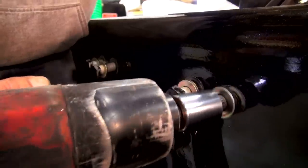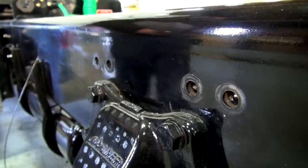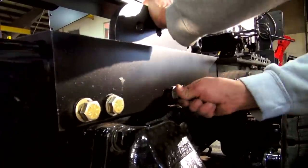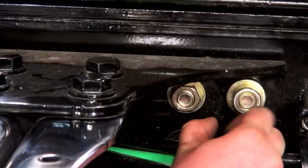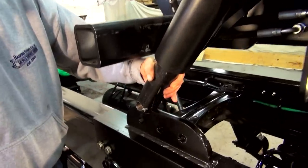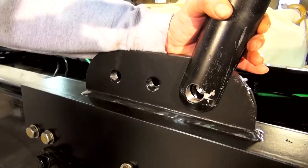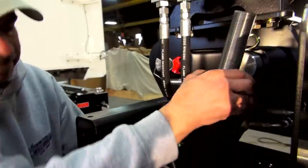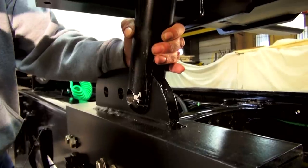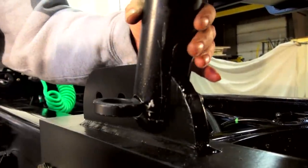Next we'll be installing our frame tabs. We do this first by removing four bolts out of the frame — typically these are around your crossmember or to the fifth wheel plate. We use these holes and scribe them to the frame tab. Now that we have our frame tabs drilled, we're going to be bolting them to the frame. We're using four 5/8 grade-8 bolts and just snug these up until they're hand tight. Now we'll install our strut mount over a pin located at the front of the ZAK-Lift, with the bottom of it slightly forward towards the cab of the tractor.